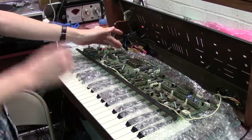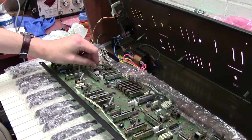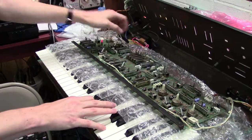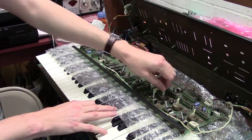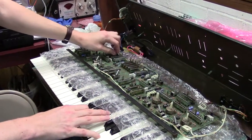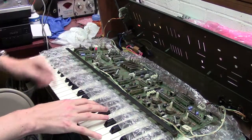I also want to show you something I didn't bring up last time. This is actually like the Polymoog resonator section — just one part of it though. You've got, I think, low pass, band pass, and high pass. So it's very similar to how the Polymoog works in its resonator. The more harmonics I put into it, the more it resonates. And that's high pass, and that opens back up. But that's like a little resonator section of a Polymoog, which is kind of cool.